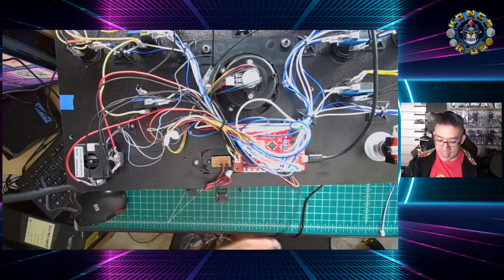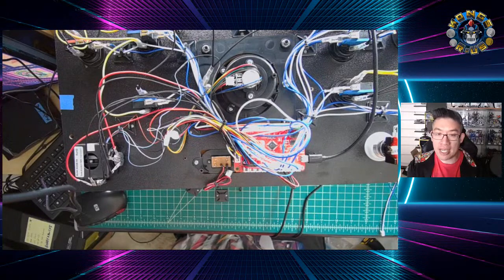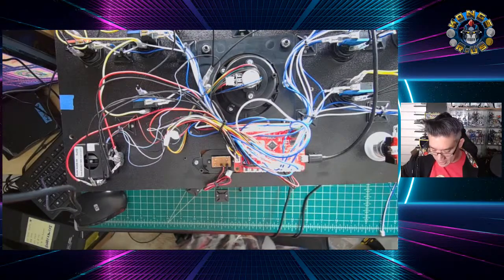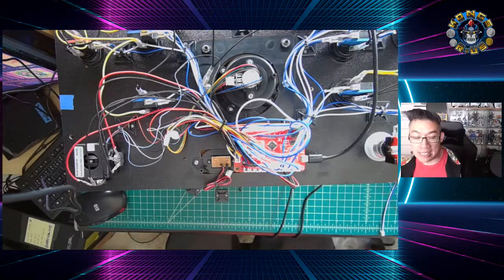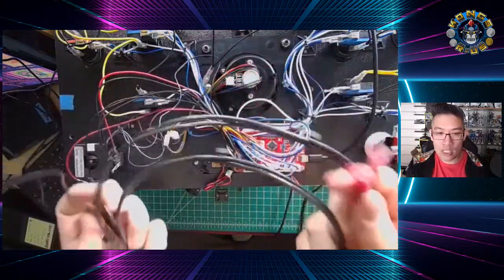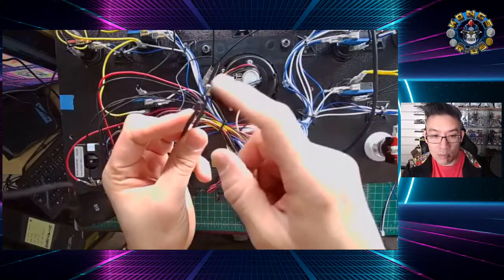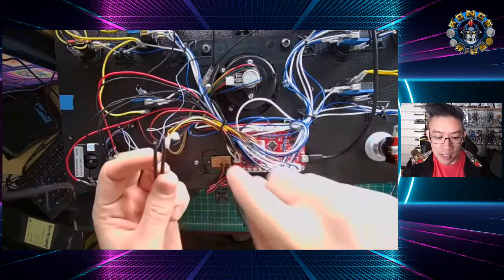and this wire that's already wired, that's going to plug into your inlet module switch and turn it on. So essentially we're creating a remote switch to turn your surge protector on inside your cab. So on one end, this is going to go into the inlet module switch. On the other end, I have these pre-crimped small terminals that are heat shrink that are going to go into this section right here.